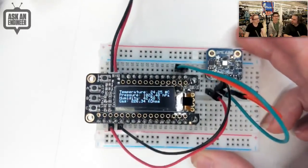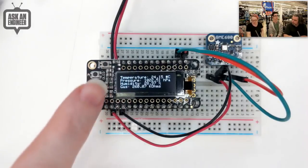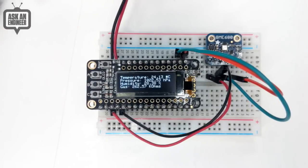You have to do a little calibration and math with these gas sensors, but it works quite well. What's nice is it's an all-in-one sensor — the most integrated environmental sensor we have. There is a library that Bosch has that can give you air quality output, but it's very closed-source and compiled binary only, so we're looking at solutions for that. For now, we suggest looking at the resistance and humidity, plotting those, taking a baseline reading of the gas sensor, and using that to determine whether you're getting more or less contamination in the air.